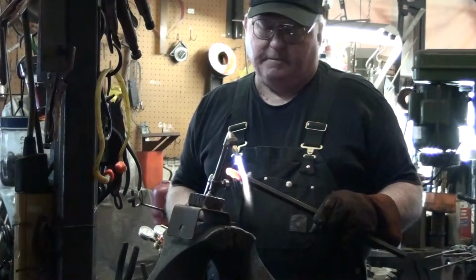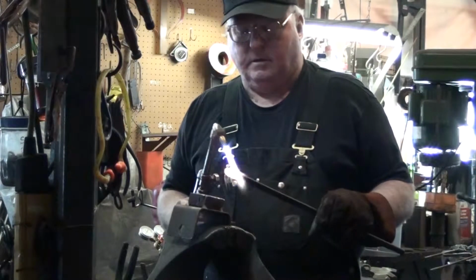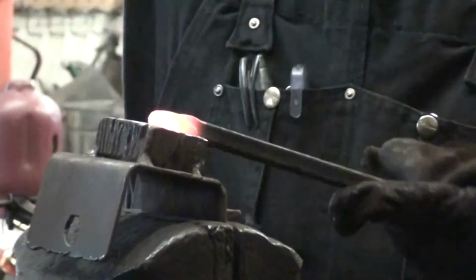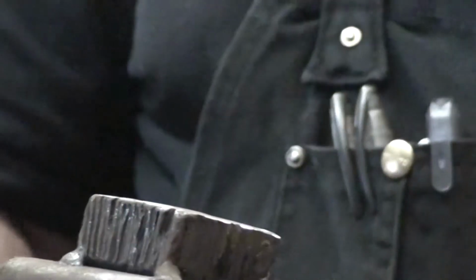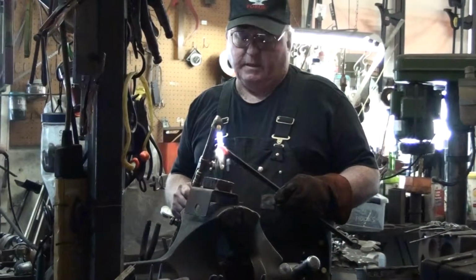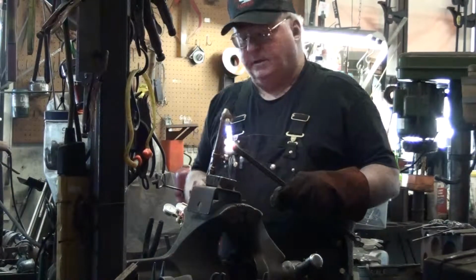But maybe you'd have a little fence project or grill or something where you needed the 1/2 inch square tube and you wanted to have some sort of finial treatment on it. This might have some sort of usefulness. I'm spinning with the twist as I forge that down to a taper. I tend to tighten the twist up a little bit. Of course, it's going to flatten the edges that were originally rather rounded, but that'll give it more of a forged look.